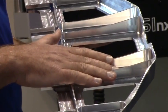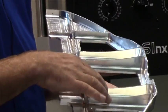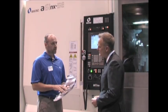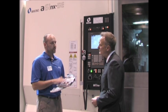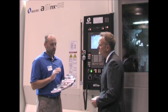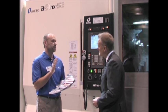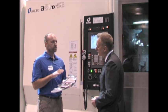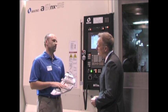For finishing the part, in this case it's a simultaneous five-axis part with a lot of motion, and we need to be able to accelerate and decelerate our rotary axes quickly. We can do that — we have two direct drive rotary tables; the B and the C are direct drive with very high acceleration. They're both liquid cooled. In fact, the entire machine is liquid cooled for stability, and that gives us accurate parts. We can get them off fast, they're repeatable, and I don't know what else you could possibly want from a machine tool.